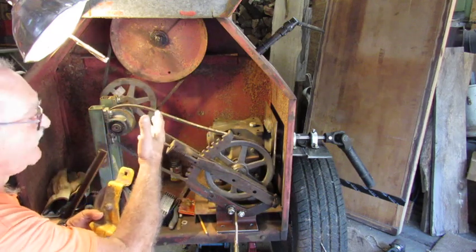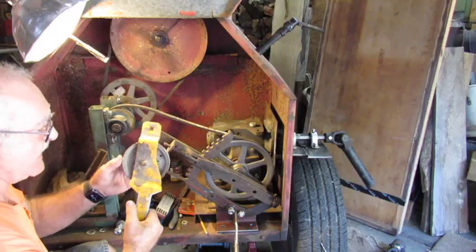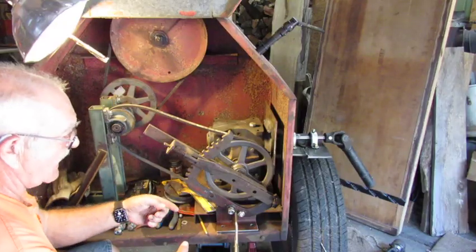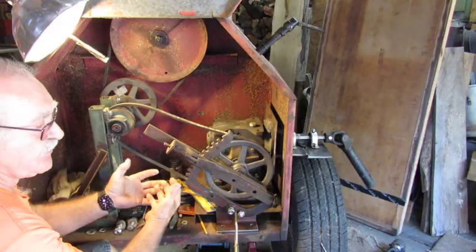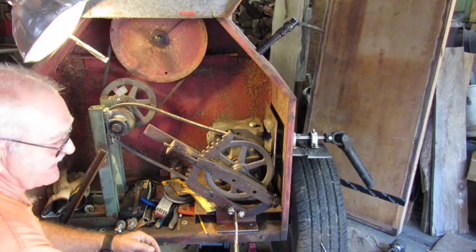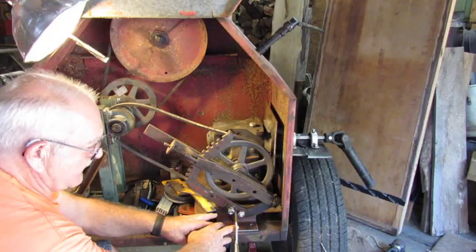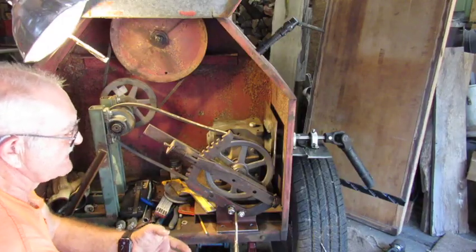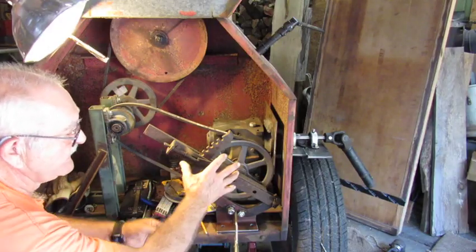So it's very heavily loaded with four or five bags of cement, which this is definitely capable of. I'll be able to slowly engage that instead of that shock. This looks like a little overkill, but I like to build stuff with things that I have in stock — I don't have to buy anything. I could put a tensioner on here that just uses a spring and holds all the time, but I want to do this with no load whenever I turn it on. So I'm going to bolt this in place in case I have to service anything — just take two bolts out and remove this whole assembly, giving me free access instead of welding it in place permanently.